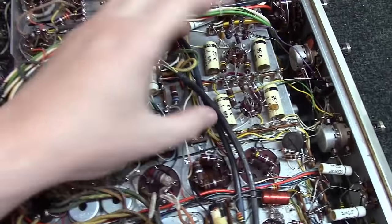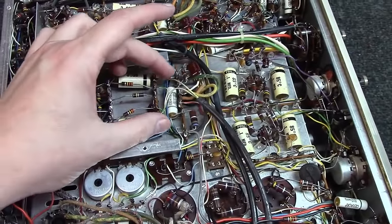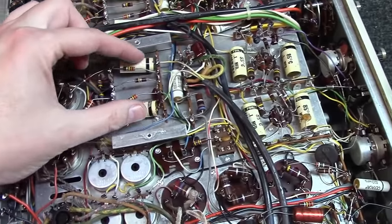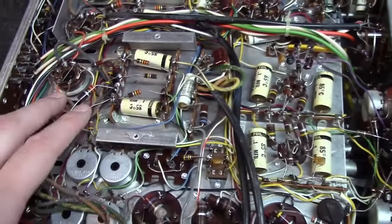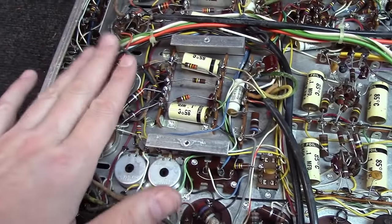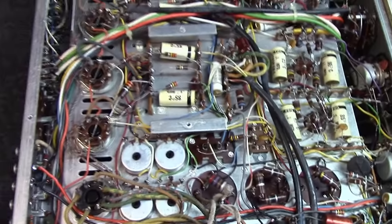The DC setup on this set of tubes, it gets fed over here, and theoretically it gets blocked right here, and only allows the AC signal, the audio, to go through to the output tubes over here. Well, if these things are leaky and letting DC through, then it changes the bias on typically the input grids of these things, and causes some really bad scenarios.